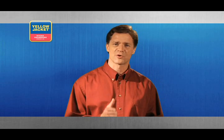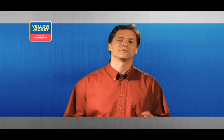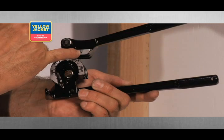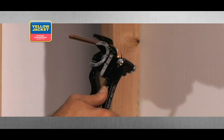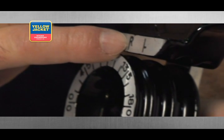To locate 90 degree bends on this type of bender, mark the center line of the first bend location on the tube. If the dimension length is to the left of the zero degree mark, align the bend location mark with the L on the bending handle. Rotate the bending handle until the tube is bent to the 90 degree angle. If the dimension length is to the right of the zero degree mark, align the bend location mark on the tube with the R on the bending handle.